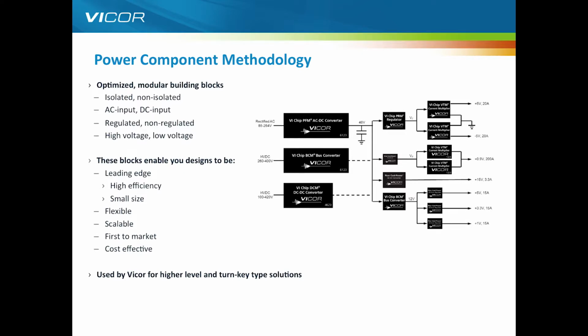Obviously, in a military system, we'd be talking 270 volts DC coming in, and then usually a 28 volt bus, according to MIL-STD-1275, in that midpoint, although there are many applications like an actuator for the nose wheel. For example, a company like Moog might take in 270 and just have a very small converter within that device directly driving the actuator for the nose landing gear. And obviously we go from 270 volts directly to radar jamming transmitter amplifiers rather than going through a separate 28 volt bus.